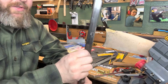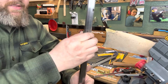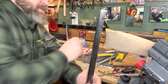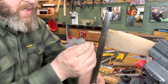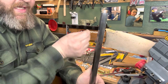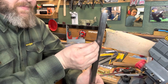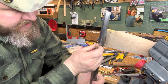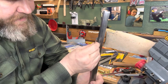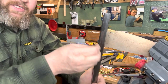The next thing we're going to do is find the halfway point for our tenons. We have to fit these pins through the wood stock blindly — through the middle of the tenon and out the other side back into the wood stock. There's not a lot of play when it comes to positioning — not much up and down or left and right, a little more forward and back.